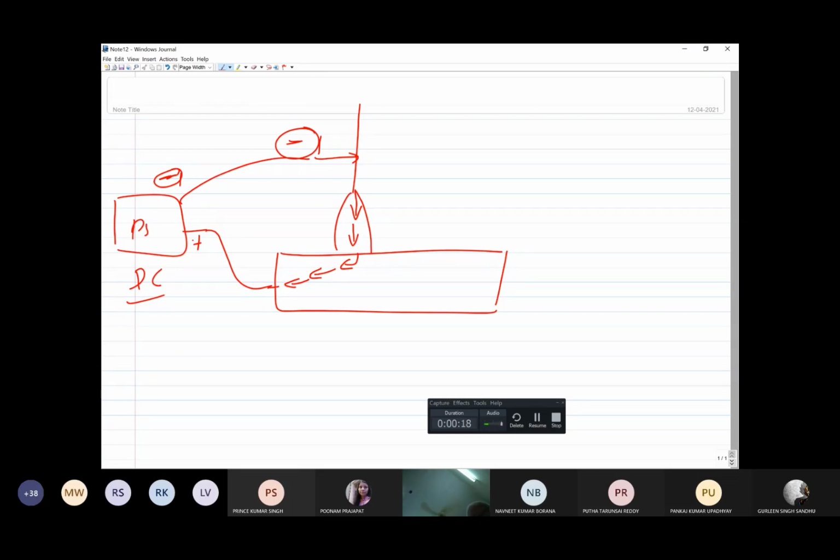So in this situation, when the current is flowing, an electromagnetic field will be generated around the arc as well. Wherever the current is flowing, an electromagnetic field will be generated like this. Current will always follow the path of least resistance. So here you see the interaction between the electromagnetic field of the arc and the electromagnetic field of the base, because current is flowing through the base to complete the circuit.